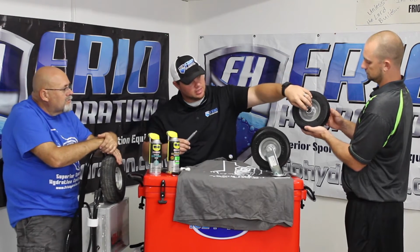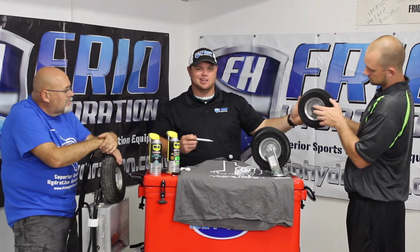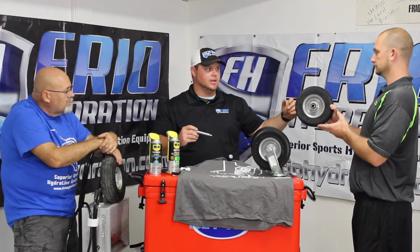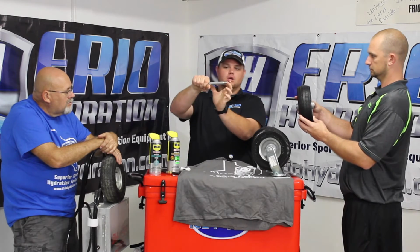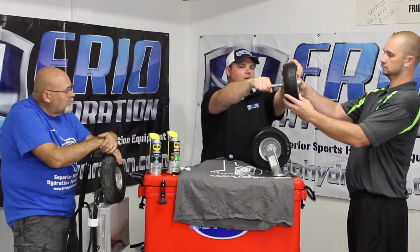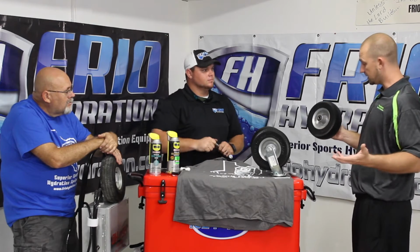The next thing you're going to measure is the diameter of the bearing. These ones here in particular, and generally what we found, are 5/8. But always measure yours to make sure, double check. And then you're going to measure the length of the shaft that the wheel will be going on. You're going to measure to where the bolt goes on, and that will tell you how big the hub needs to be. The ones that I bought, the threads didn't stick out past the hub, so I had to go back and get one with a shorter hub.